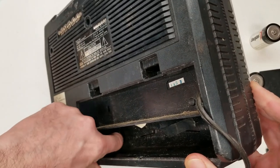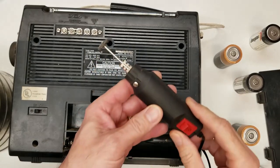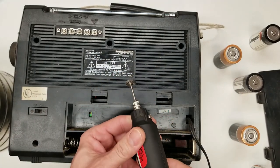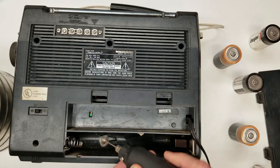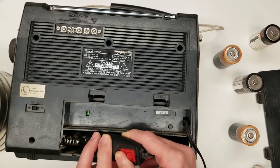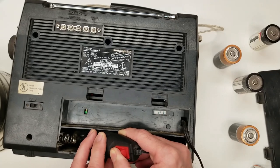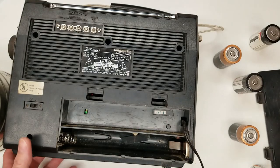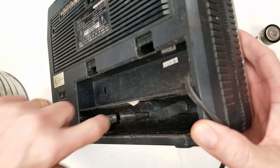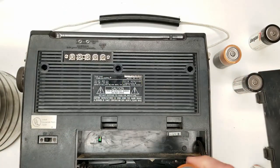There's a little bit of crud on the battery contacts. I'll take a little wire brush and try to clean that off - that might be the whole problem right there. I've got my Harbor Freight grinder here, my little Dremel knockoff - it's definitely seen better days. I'm just going to reach in here and clean it up. It's definitely a lot better than it was - oh yeah, definitely better. Let's go ahead and load some batteries back up and see if we made any progress.